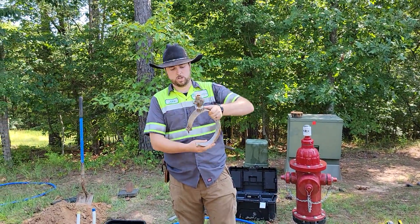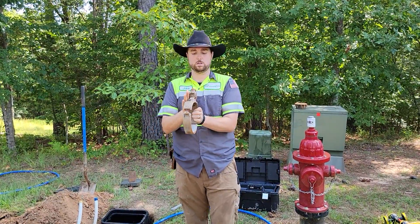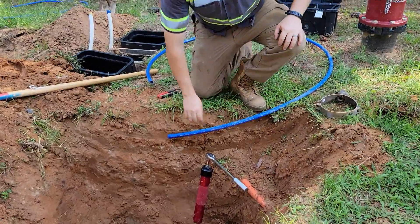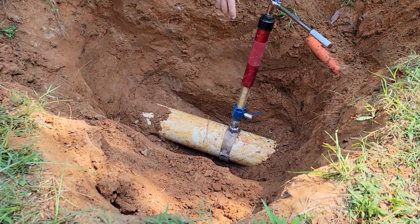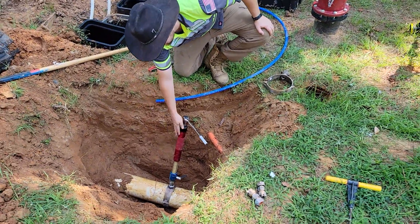This tap literally will slide in around and go over that water line. We lock this down, and this is a valve. This valve will be opened — you can see we've already got this half completed here for you. We're setting two taps today; this is the first tap we've got started on. We've got our brass tap here on our six-inch water main. This is all unmetered water, high pressure, and this is a tap tool.